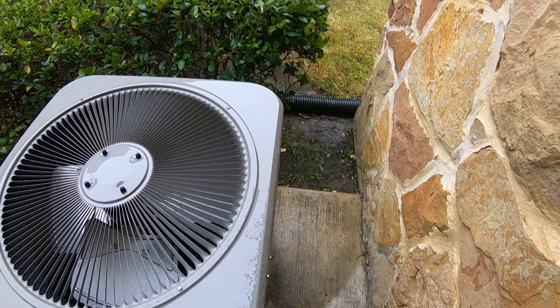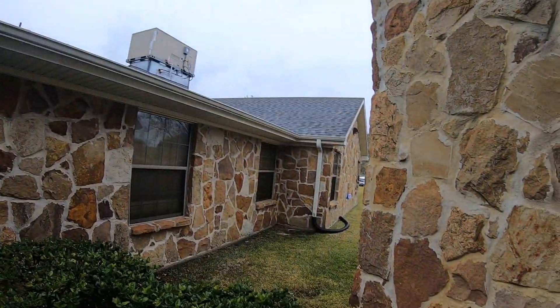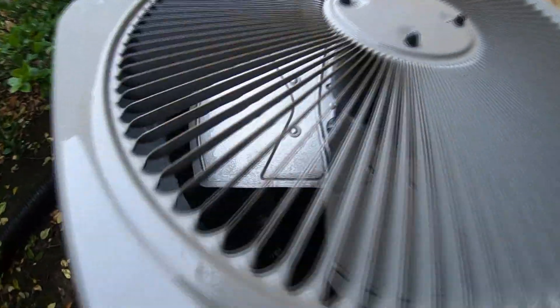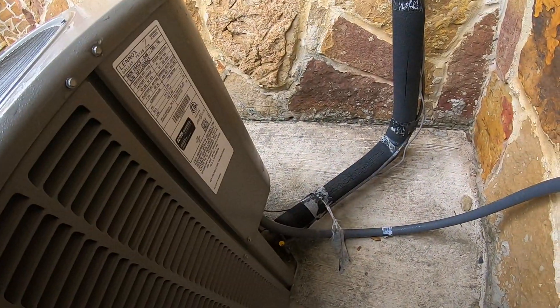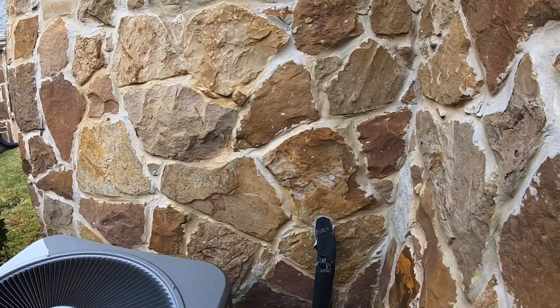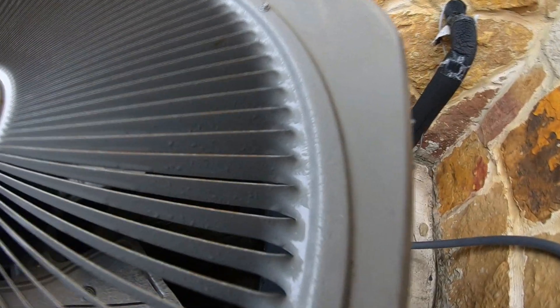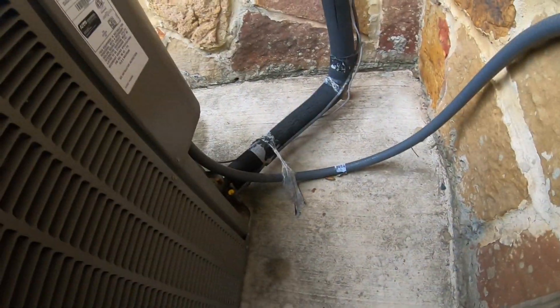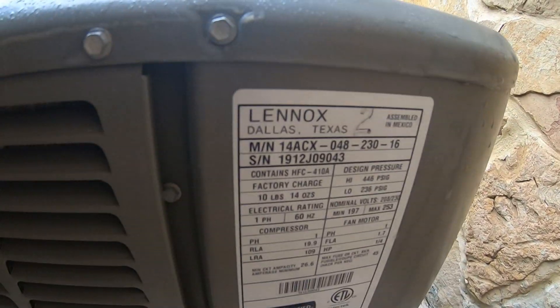All right, I'm going to button this up and go outside, get the pressures, leak check outside. This is the unit right here. It's kind of sleeting out here — I don't really see any residue or anything on here and I'm not going to bring the H10 out here because I don't want to risk sucking any water in there. It's kind of cool out here, it's gonna rain all day. I'll come back on a better condition day and maybe check out here — hopefully the leak is not on the line set. Just doing a visual inspection I don't see anything. They're running the heaters so I'm not going to turn the air on — I might hook my gauges up and check the standing pressure, that's about it.